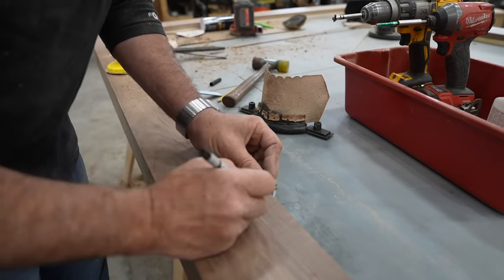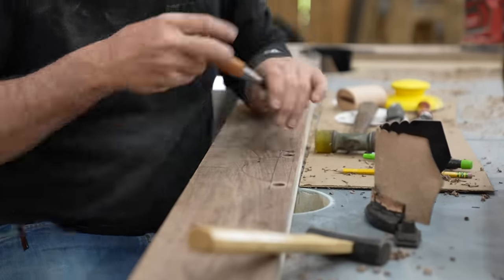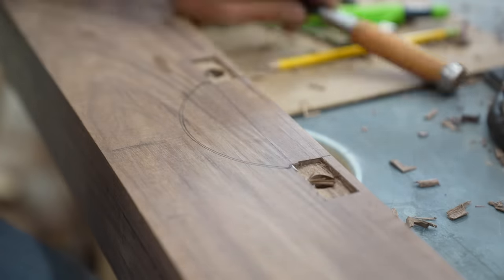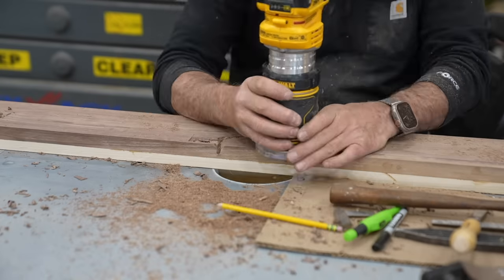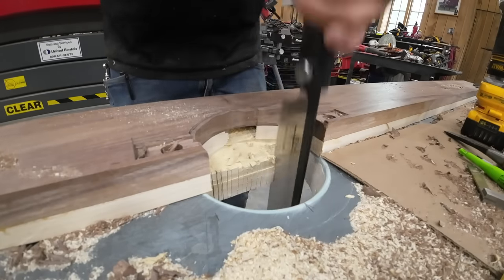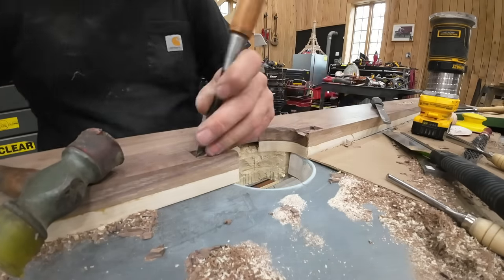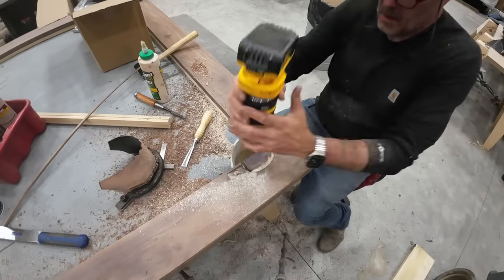So there's not the tightest miters on the corners. Now I'm carving out the space on the bottom of each one of the pockets. The pocket has a bronze casting, and the bronze casting accepts a bolt from up and underneath. There's a little bit of structure underneath the bronze casting that you need to chisel out. I'm also preparing for the router cut — I start hand chiseling it to define my line because it's going to live directly along the edge of the leather pocket. I used a pull saw to cut out a lot of that material, and ultimately I went in with a saber tooth disc and polished out the inside of each pocket.